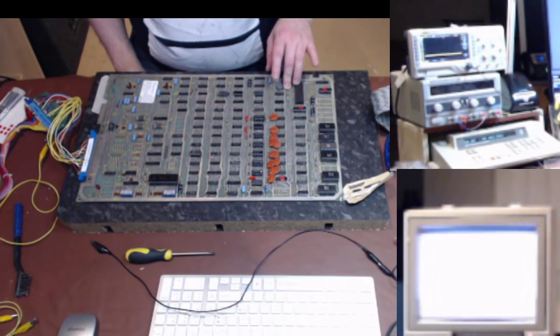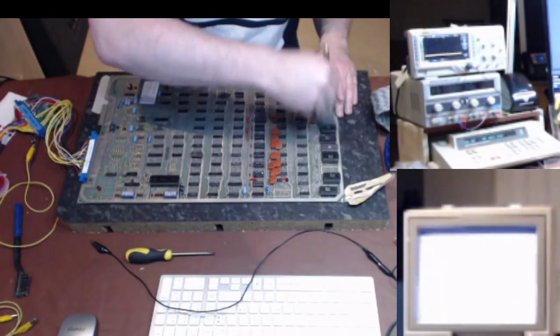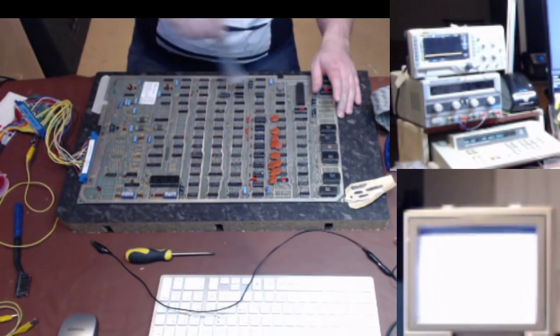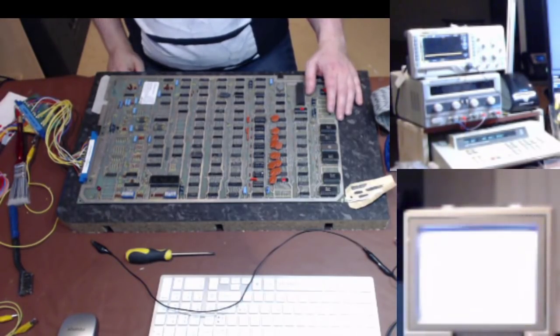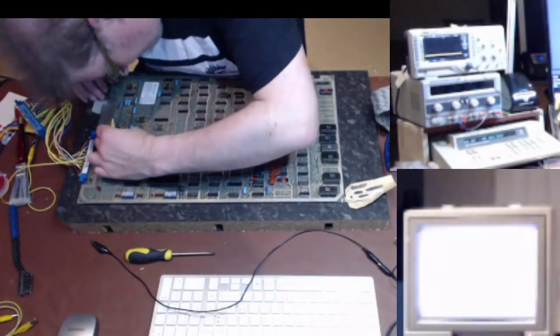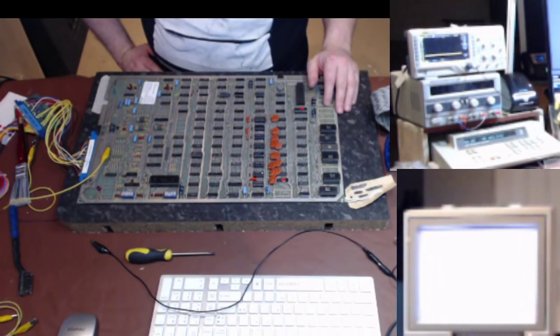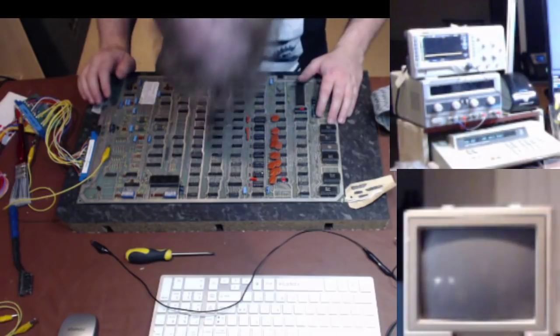Yeah, it's just constant reset, that. All the ROMs all seem fine. And did we get some schmoo or something like that on the board? Well, that explains why the Fluke wasn't doing it then. Okay, V blank circuit. I'll have to read that schematic, but I could have dropped a piece of solder on this, I guess, couldn't I? Look.